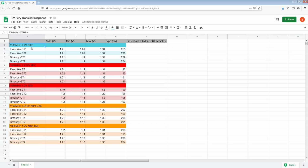The problem with doing that is that, especially with something like a Fury, these things are extremely temperature sensitive. Like 2 degrees temperature difference can easily make the difference between finishing a benchmark and not. If you're trying to do stability improvement comparisons, that really throws that off, because you need very accurate temperature control, and obviously the easiest way to deal with that would be to have a chiller or something, where you can just set the water temperature and it'll maintain it no matter what. But I don't have a chiller, so again, equipment limitations.